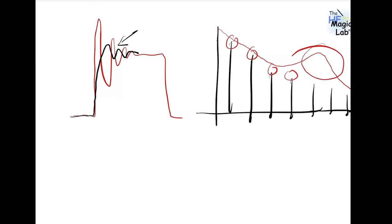Can you emphasize the quasi-peak and average measurements, the difference between the two, and any best practice considerations we should follow? Well, you have three basic detectors: the peak detector, the quasi-peak detector, and the average detector. The peak detector looks for the peak of the EMI you are injecting. The average detector identifies the average of this signal. And the quasi-peak is a kind of detection of how repetitive the peak is. So you can have a peak of some value that is not repetitive or happens only after a long time. A quasi-peak measurement usually takes more time.